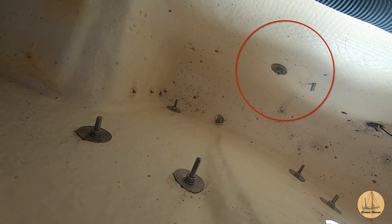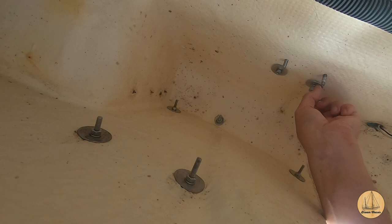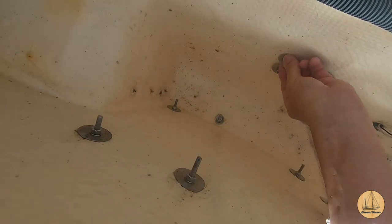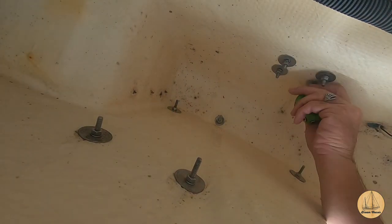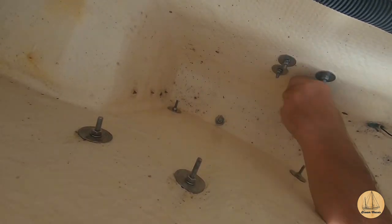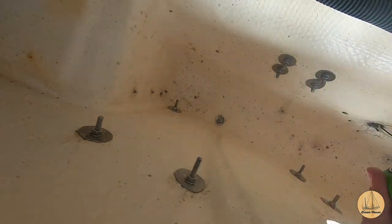With the one-inch bolts swapped out for inch-and-a-half, I came back to the boat and removed the three bolts that didn't have a nut on the back, then put those in and used my hand to place the backing plate. These are one-inch stainless steel washers along with a lock nut, and then I'm using a quarter-by-20 nut on the back side. Anytime you're installing a cleat it's very important that you have a backing plate — if all you had was a washer and a nut, any pull or tug could rip right through the fiberglass. By putting these one-inch or larger stainless steel washers on, that gives it the strength of the backing plate. Once everything was finger tight I used a little socket set — about the size of a hockey puck with different socket holes in each end — holding it on the nut and using a screwdriver on the top side to tighten them up.